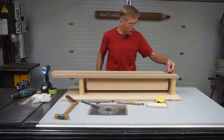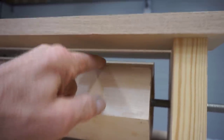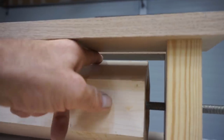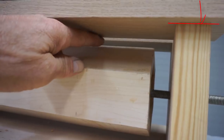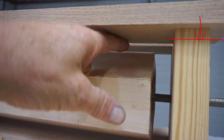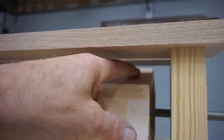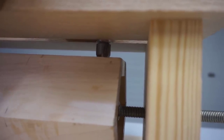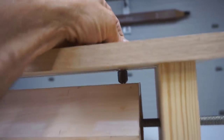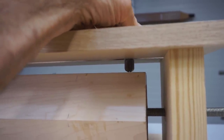That should be just right. There's enough room between the bottom of the rails and the points on the hexagon to allow clearance. But as I said, I could have shortened these end blocks by 5/16 or 3/8 of an inch to get the initial cut closer to the blank, because ultimately the 4-inch diameter is going to be at this level, which means the router bit is going to be extended down quite a ways out of the router to make that cut. I left it like this in the video so you can see the margins that you can use and still have a successful end result.